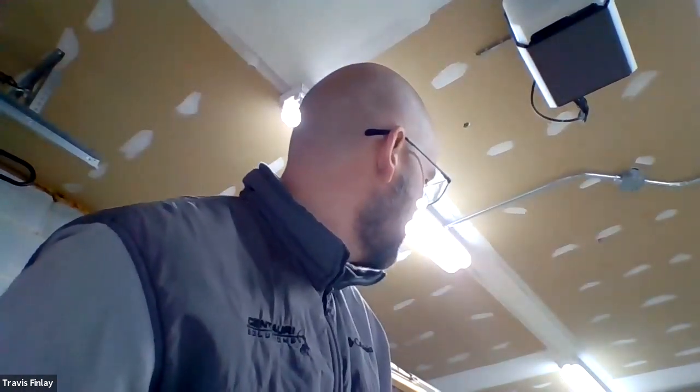So home it and then try a jog again. And you haven't done any work with work offsets or anything like that, correct? No, I haven't got to that point. I haven't really done anything other than move it and verify that it moves the way it should. Gotcha. Now just try jogging it over. Out of curiosity, when you say go home, it goes to the same exact spot every single time? Yeah. My home is slightly off from where it was before I upgraded the firmware because I haven't set it properly, but it does continually come back to the same spot.